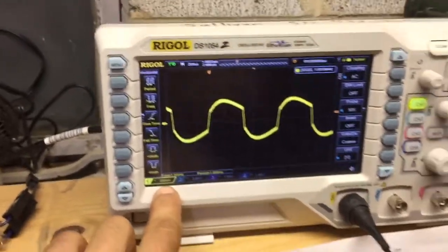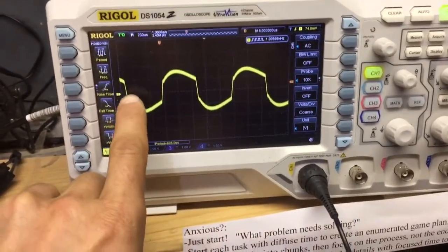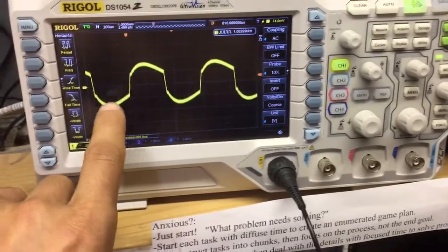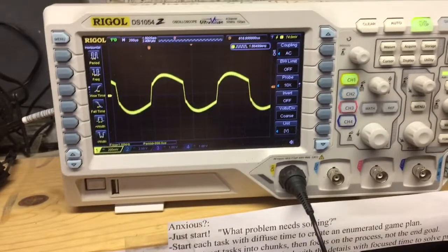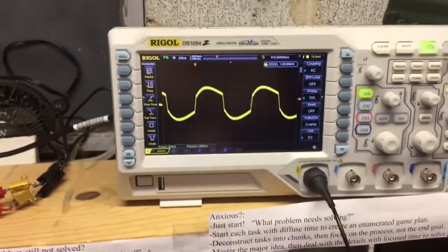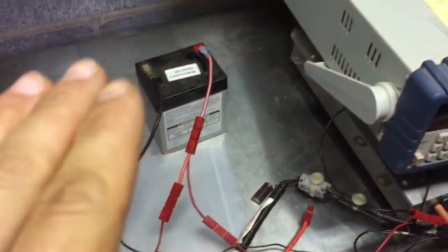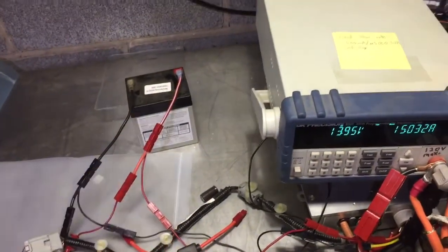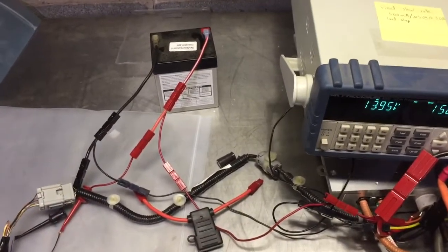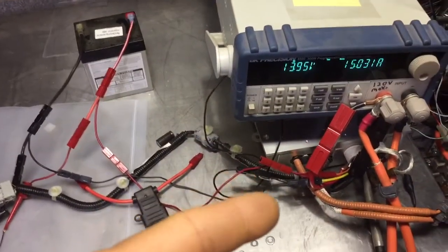So what we're saying is that on a 14 volt signal, from a 10 to a 20 amp load step, we are getting a plus or minus 400 to 500 millivolt change. We're going from 13.5 to 14.5 volts when we have this huge load step. Now this battery is helping. In this case, I have intentionally put some high gauge wire here to simulate the length of the cable from the battery in the hood to the actual IMA bay where the DC-DC converter is located.